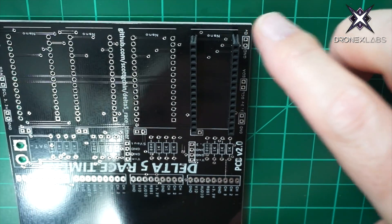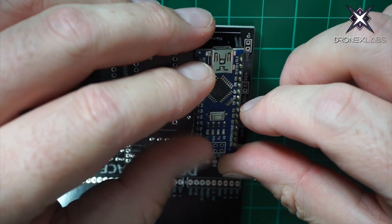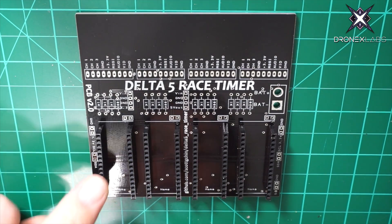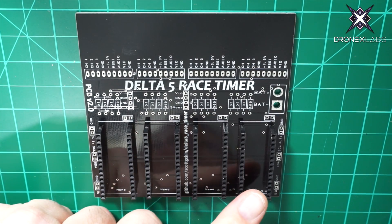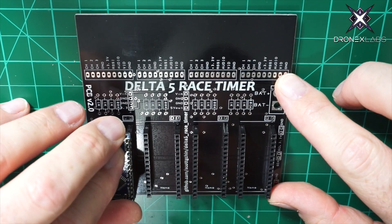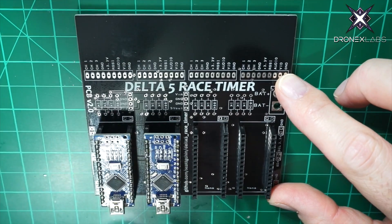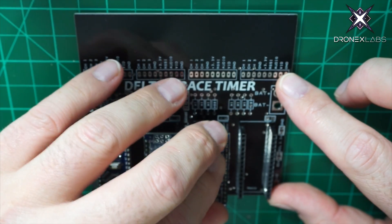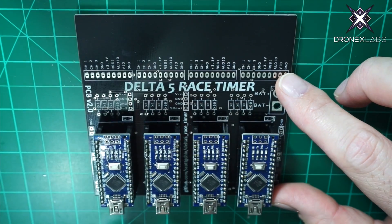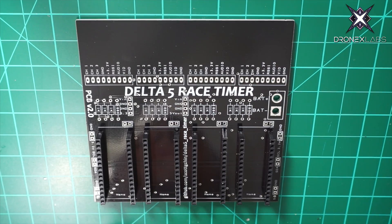I use pretty good heat and don't like to stay in one spot too long. You can see both rows — no clipping necessary and it's all square. You can easily take an Arduino and drop it right in place. Here are all of them completed, and I'll just test fit each one of the four Arduinos to make sure everything lines up and feels snug. This is completely modular, so if something gets damaged you can easily pull it off and drop in another one.